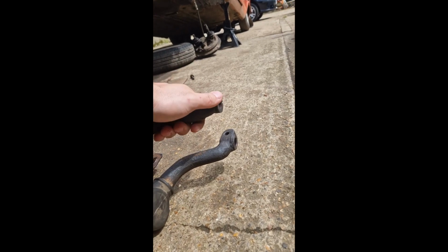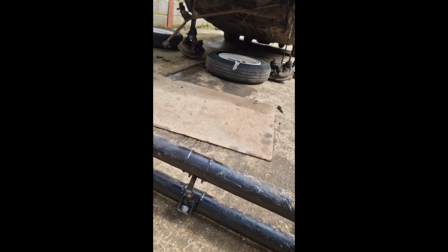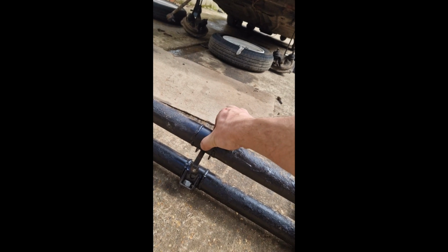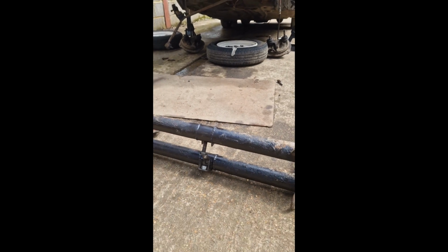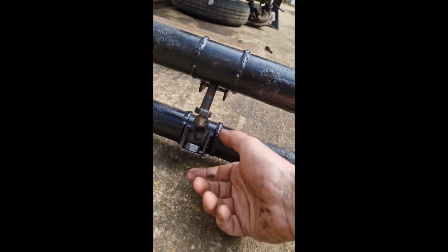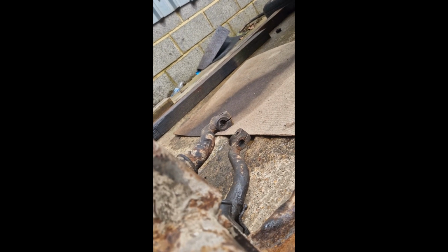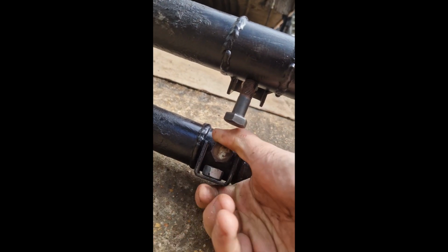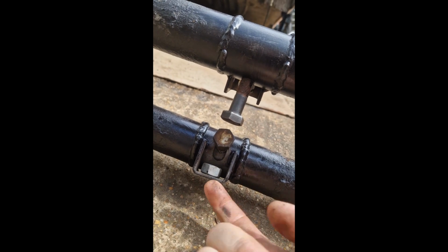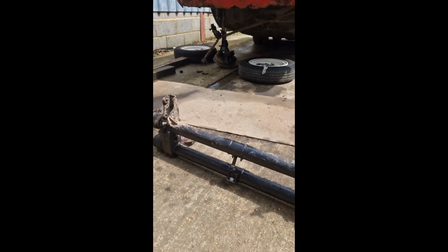So you've got your upper suspension wishbone and your lower. Normally you've got a torsion bar that goes through the middle, which is still the same as this, and then they're fixed in the middle. Basically there's a bracket inside that's spot welded to stop everything turning, and then obviously you put weight on the torsion bar, and that's your suspension. But what we've done here is we've drilled out the spot welds and we've added this adjuster, so this bolt can move up and down, and that adjusts the height of where the lower arm sits. So obviously when the weight of the car comes down, it will be on the bottom point, but if I want to raise the car, I can put a bolt through here which will push this upwards, which in turn will lower the arms, and then there you go, free lowering.